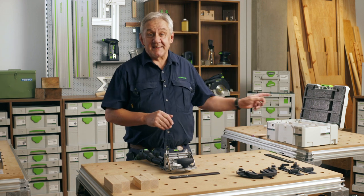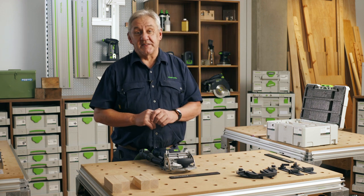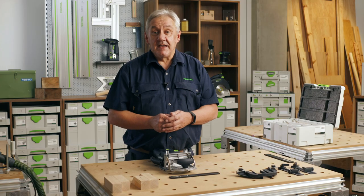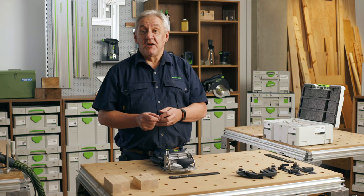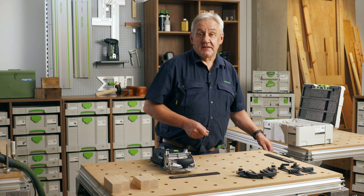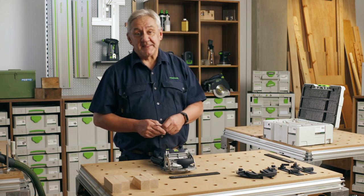If you run low on any size, you can pop into your local Festool dealer and buy a blister pack of dominoes to top up your Systainer. Similar kits are available to complement the DF700 too. It couldn't be simpler to change your domino size. There's no special setup, simply change the cutter and that's it. The clever geometry of the machine sorts the rest.